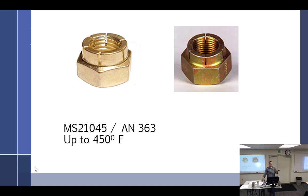So the nut that is that much away from the probe up here, attached to the cylinder, the way it's hitting in air and stuff, probably isn't that hot, but I would say it's safe to say 1800 to 2000 degrees. So, would this meet that criteria? No. So, it's a low-temp, high-temp nut. Do they make a very high-temp? They do. No. They're not CAD-plated. Because what happens at 450 degrees? The CAD-plating bakes into the base metal and becomes extremely brittle.